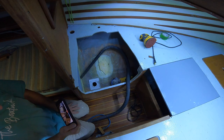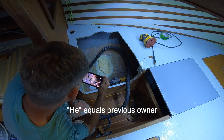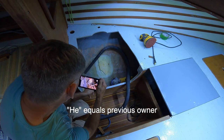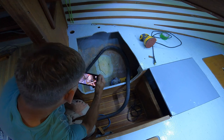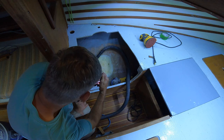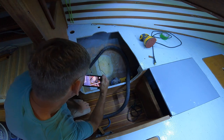This is my Compact 23. This is where the previous owner had a through hole where he attempted to put in a marine head and just couldn't get it worked out. So I'm going to try to grind this up a bit and put a reinforcing patch over that, then put a backer block in it and install a depth transducer. It's not the absolute perfect spot, but the hole's already there, so I'm going to use it instead of glassing it over and drilling another hole just a little further forward.